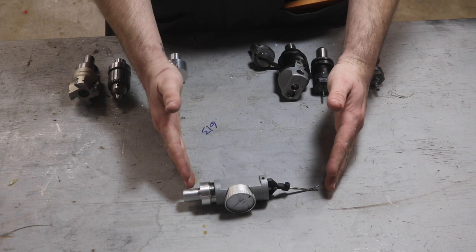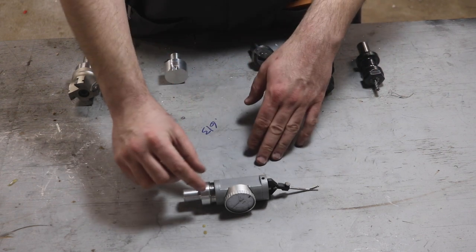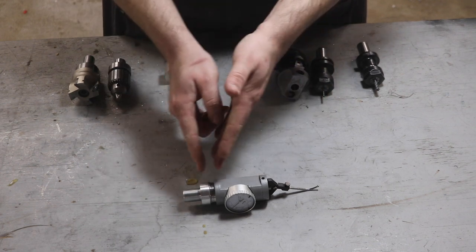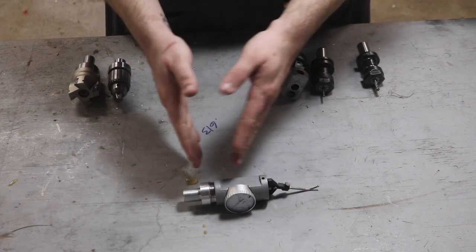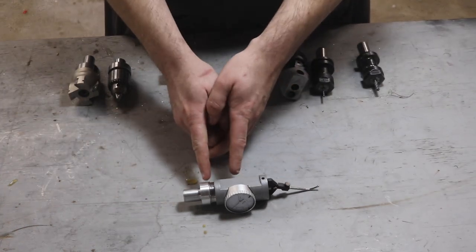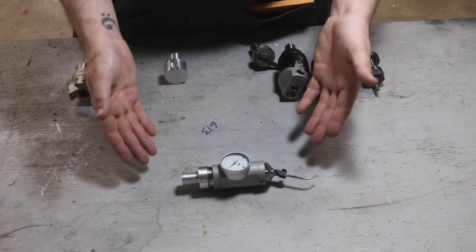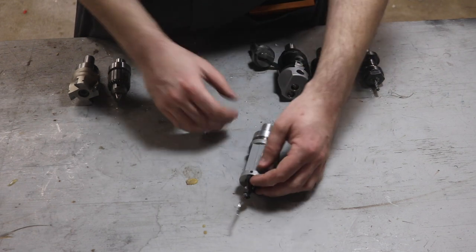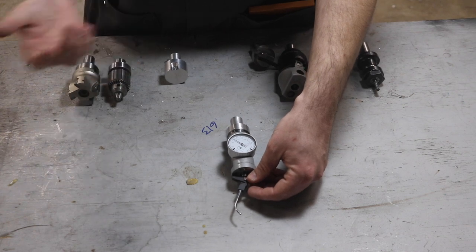It's actually kind of long. The machine doesn't have that, and it's got a taper that goes pretty far up. So if I was to hold it just at the face of its taper, that would already add maybe a half an inch of length just in this setup, and it would be a lot longer if it was an end mill holder — that would add another maybe inch and a half on top of that. So this takes a relatively long item that goes into the spindle and actually puts it in just about as compact a package as we can ask for.